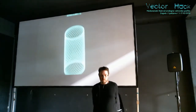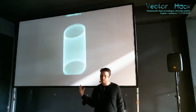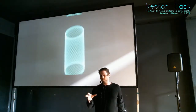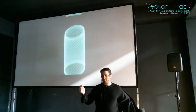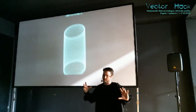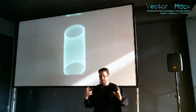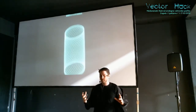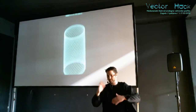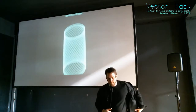Yeah. Normally you'd want sync to be fixed, because if you're going to film the output, you'd want it to be stable. You'd set your camera frame rate to match. If you've ever pointed your camera at a television and seen it flicker and create bars, it's because your camera is taking a different sync rate than the television sync rate. So you want those matched and constant so that you don't get any undesirable artifacts. It can be variable, but then you start getting flickering if you're filming it. If you're watching it, you normally don't see it.